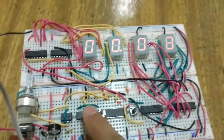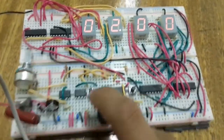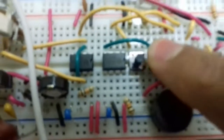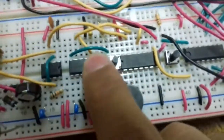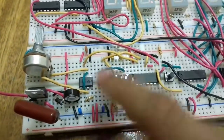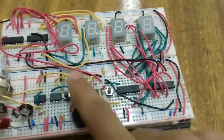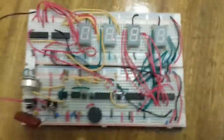I put a piezo buzzer in the circuit so it makes a sound when I start and when I stop — though the sound is very little. Even if I increase the voltage, the sound remains the same because I have a voltage regulator, so the voltage stays constant. If you increase the voltage beyond the regulator, you can hear the sound more clearly. You can also use this as a track timer circuit.